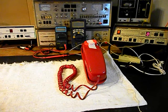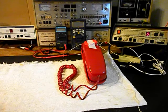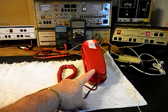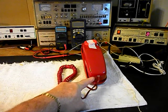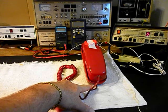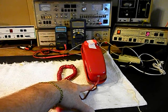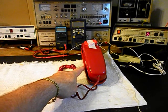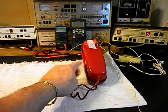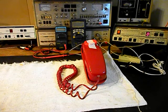We're back now and we are finished with the repair of this really cool Western Electric Trimline Telephone and we're ready to start our final checkout. The modular port at the handset was replaced, the plug for the handset cord was replaced, and the modular port at the base and the plug at the base on the handset cord was replaced. We worked on the line cord modular port, we also rewired the block. There was some improper wiring going on and that was taken care of, and the bell circuit was not connected properly. So there was a lot of work that went on.